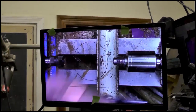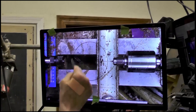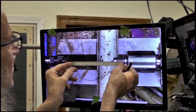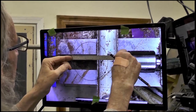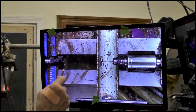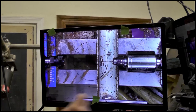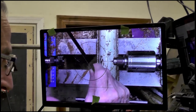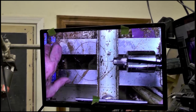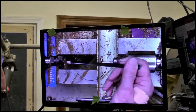I'm back to the view that I wanted to show. What I've done is I have a piece of clear plastic with a circle drawn on it — and in this case, my circle is about 12 and a half centimeters, or just under five inches. The center point is here and I've aligned that center point from my drive center to my live center. And when I turned the finial, I put my drive center in that chuck to do that alignment — it's critical that you have that alignment between the two.